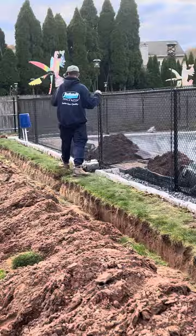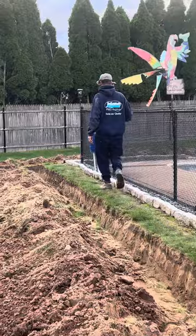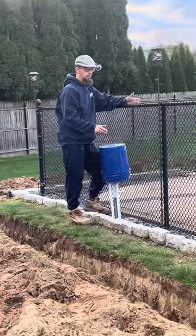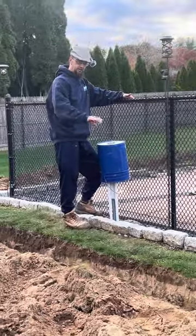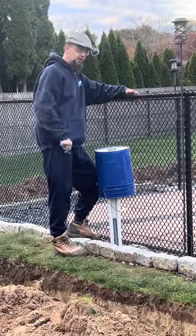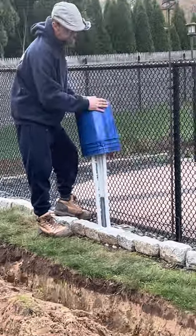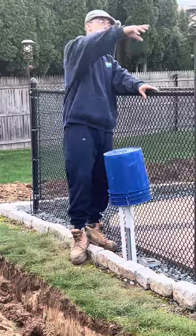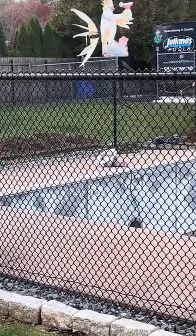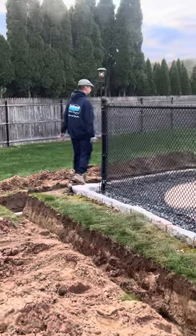This is a junction box for the light here. We got our blue bucket over it here. The light in the shallow end was bad. We tried taking the bulb out of the fixture and it just snapped right there, and we weren't able to get that little receptacle out of the light niche. So we took our light conduit, or our light junction box, apart. Tomorrow we'll re-snake a brand new light in. Our light in the deep end we got replaced with a new light bulb, and that'll be good. It'll have all new parts.